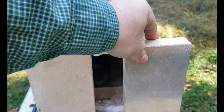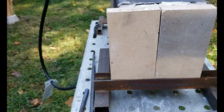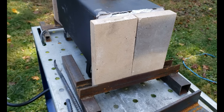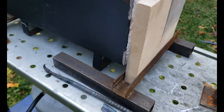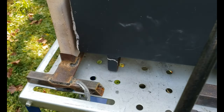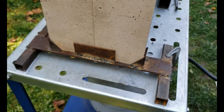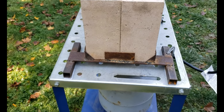The front doors are movable. The back doors I made more static — one brick can be removed or both bricks, whatever, to allow longer stock to go through and heat up. It's just fabricated pieces of stock steel and it helps me get the forge up to nice forging temperatures.